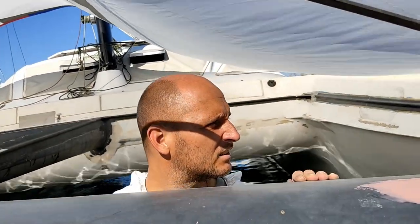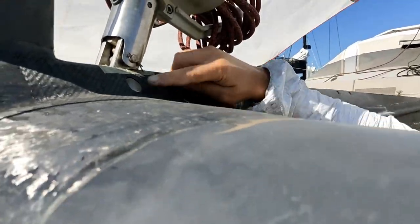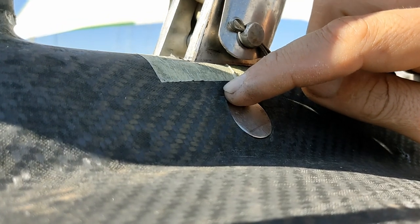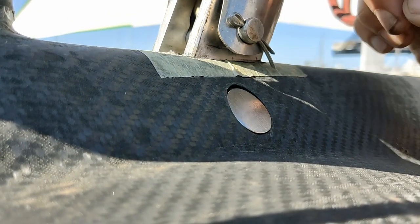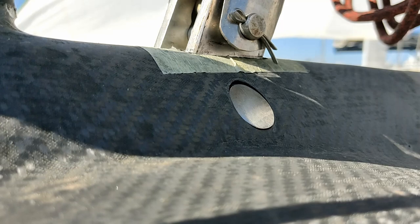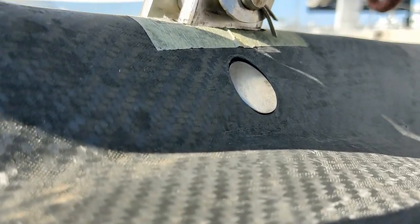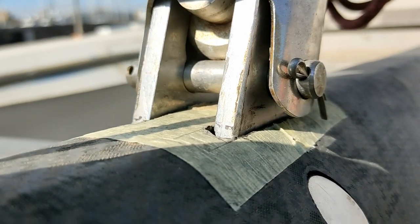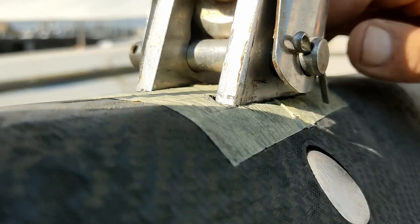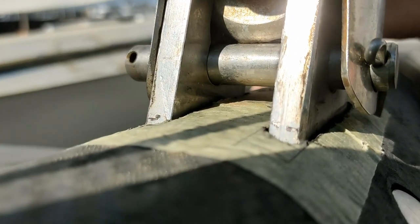You're going to make some modifications? Yeah. Well, what are you going to modify? Instead of having the taped-off pin, I think I'm going to square the pin up, put a block in here, so I can increase the bearing area and I can lock the pin off in a different manner rather than having a cover on it. Oh, because originally we were going to put a cover over that nitronic rod there, right? Yeah, just a cover over it. Weren't you talking about beefing it up a bit too? Yeah, so when I square this up, I'll make the top thicker. It gives me more bearing area. Just because I want to increase the safety factor from lots to crazy amounts.